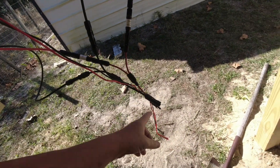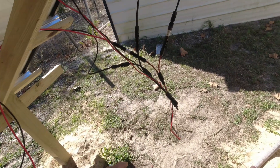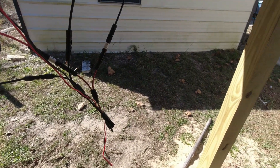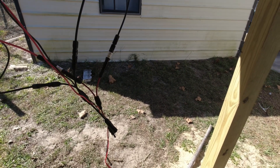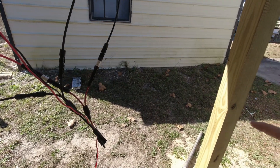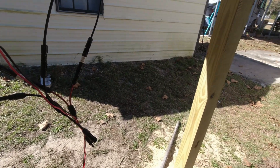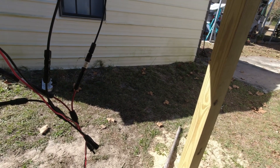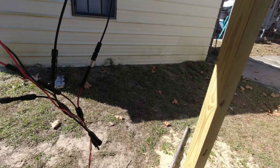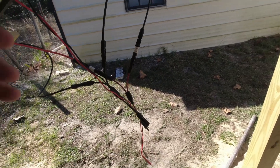From this point forward there'll be a box I'm going to put on here — these will plug into it. Some people use a combiner box, but I have a separate box with an on/off switch. If I need to work on the wiring going into the shed, I can turn everything off from there. I'll have another off switch inside for convenience. You only need the fuse on the positive side — it's like a car battery fuse; if you only fuse one end, electricity can still flow either way and burn up wires.